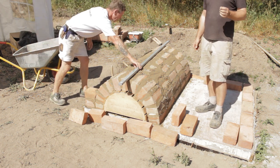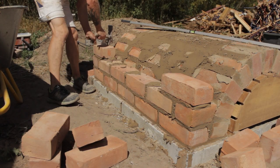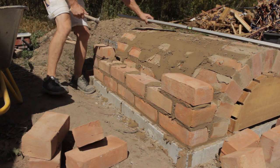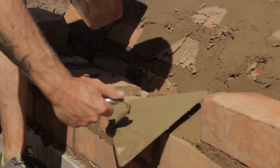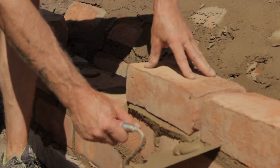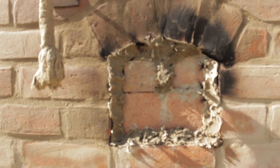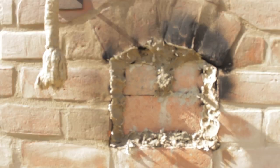It is very exciting to do these experiments here in Denmark, as it is for the first time that such a furnace is recreated for an archaeological experiment. This furnace is a scale model, but will still be able to melt 350 kilograms of bronze. This is one of the openings used for charging the metal into the furnace. Let's have a look inside.